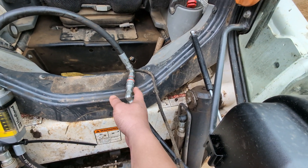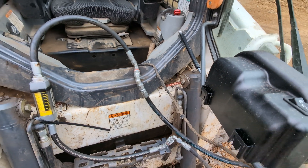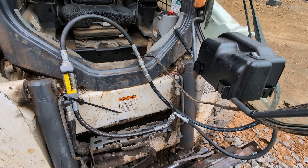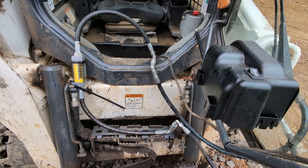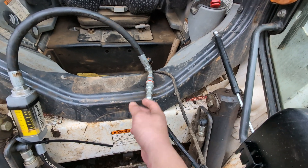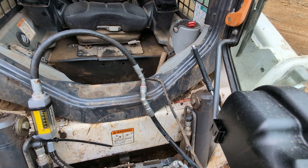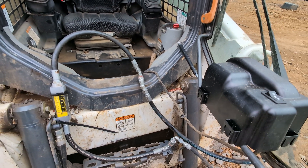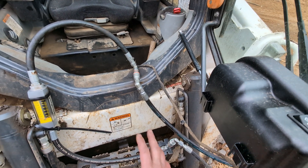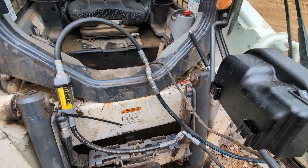The question is about these quarter-inch couplers. If you look online you might see flow ratings probably as low as three gallons a minute and as high as maybe eight. The question is: if it's rated for six gallons a minute, will it handle the nine or ten gallons a minute we have with the Stage 3 1-Series, or the twelve gallons a minute with the Stage 2 2R3E solution? The short answer is yes, and I'm going to show you that.